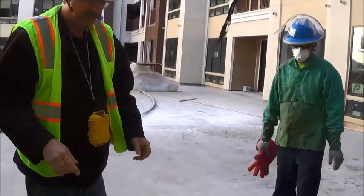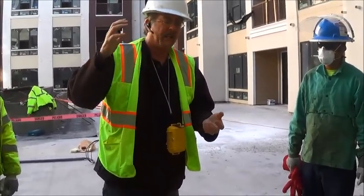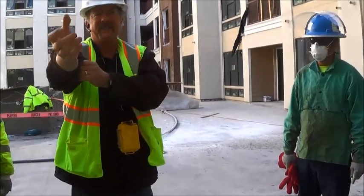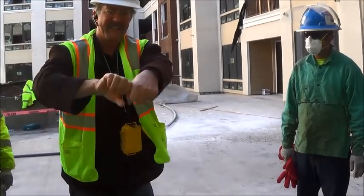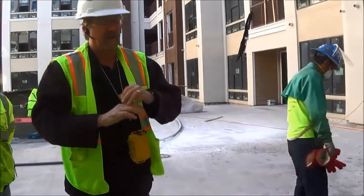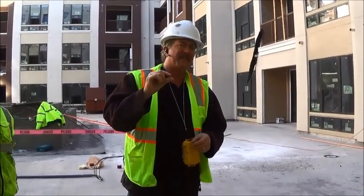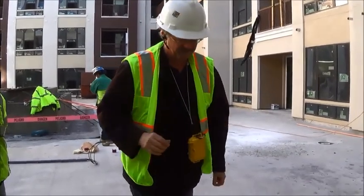So what you do is, when you're priming metal or plastic with the buckets of primer, always rag wipe it. Don't try to brush it on, don't try to spray it. Take a rag, put big green gloves on. Tremco's got gloves that go up to here now. Let me just take my rag, dip it in, and I rag wipe plastic or rag wipe metal. Hot rubber will stick 5 times better if you do that. If you try to brush it on and it gets too thick, now the hot rubber's new substrate is the primer. The primer's soft. It's too thick.